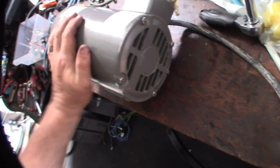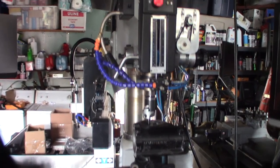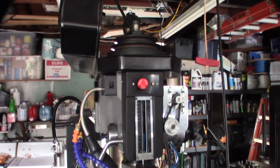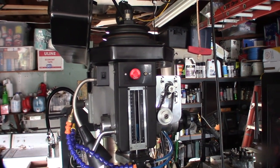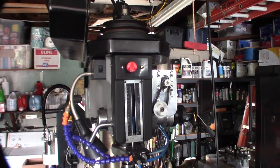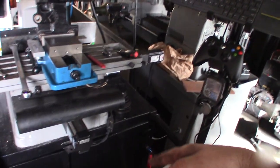The new bearings are working - hopefully it all works, I don't see why it wouldn't. In future videos you'll probably see this mill, because I'm also going to be switching from multiple belts - I can't stand changing those belts - to a one-to-one belt setup so I can control the RPM speed via a VFD that I have in my cabinet.